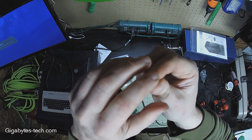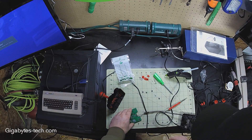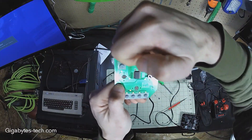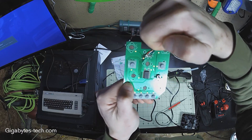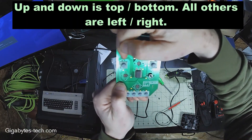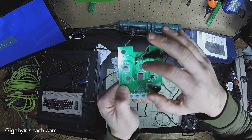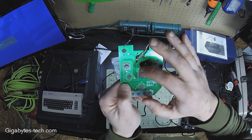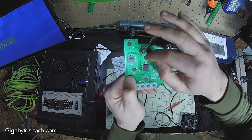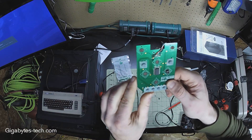On either side is the contact for the switch. You need to pay attention to the board, because the contacts for the ground and the positive side are different for each button. For left, right, and the fire buttons, they have a zigzag pattern one way; up and down are zigzag the other way. That means one side is ground and one side is the positive side, and you have to mount the switch so that one side contacts ground and one side contacts positive.